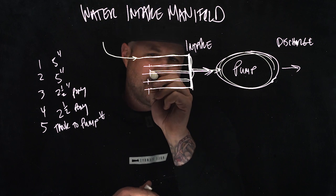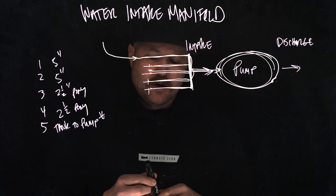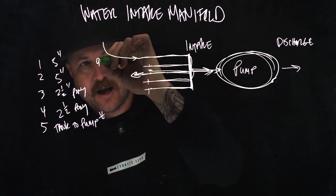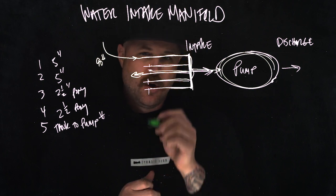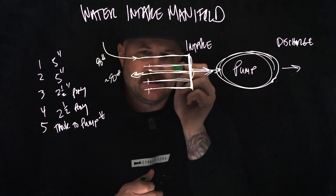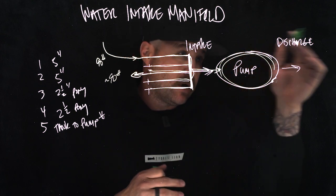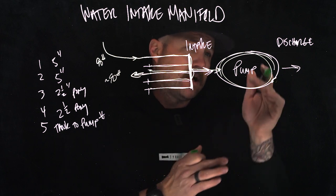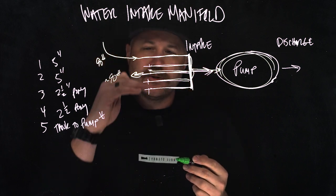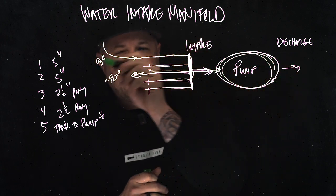Let's say we have our two-and-a-half-inch open — water's going to come flowing back out at the same pressure it came in at. So if we're connected to a 90-pound yellow top here in the city of Dallas, water's going to come back out at roughly 90 pounds. I say roughly because there is going to be some friction loss in this system. Water comes in, it's utilized by the pump, the pump adds velocity, and we discharge water at greater velocity on the discharge side. But any water not being utilized is going to fill this manifold, and all we have to do is open one of those intakes to get water coming back at the same pressure — not the discharge pressure, the same pressure it came in at.